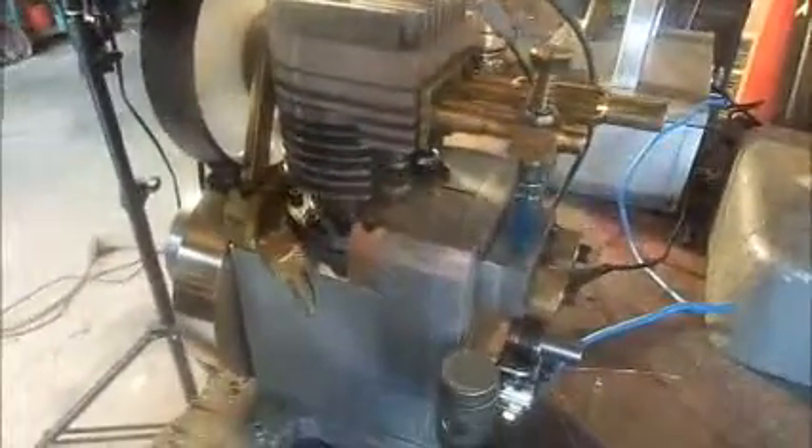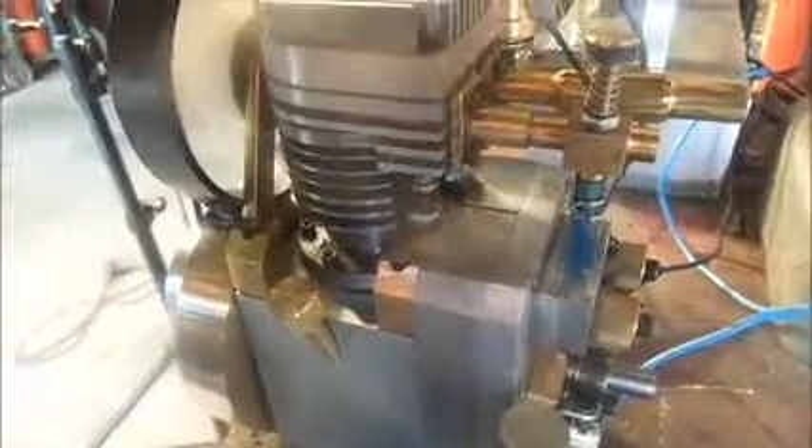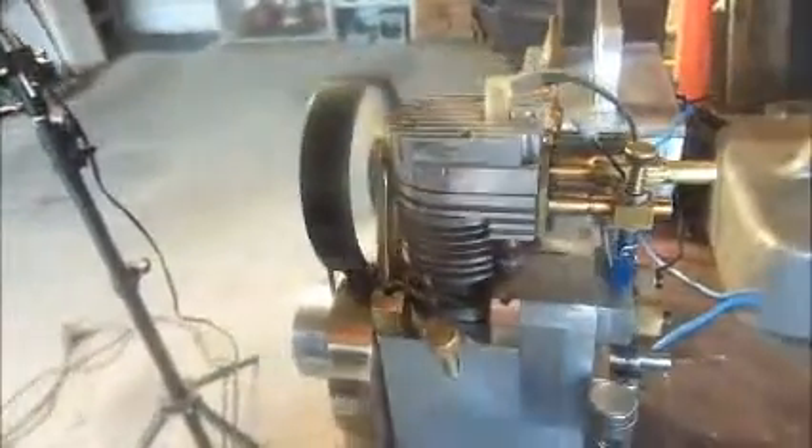If I move around to this angle here, you can see the lifters doing their lifter dance. They are operated by the dual independent camshafts. You can see the adjusters for these camshafts where my finger is pointing. I'm able to independently set the valve timing on both the exhaust and the intake, which is basically what will govern the speed of how fast this engine will rev.